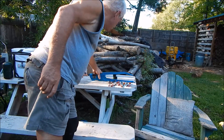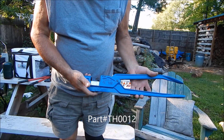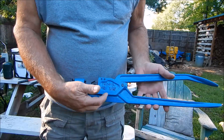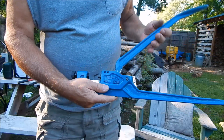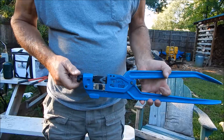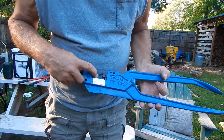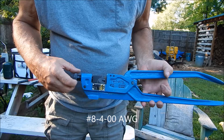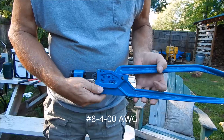The second tool tonight is the Temco TH0012, also available on Amazon or eBay. Both tools have a five-year warranty, and this one is $55 on Amazon. This is the manual crimper — it's a die-less crimper with an adjustable setting in the head. It goes from number eight gauge to 4-0 or anywhere in between just by adjusting the piece in the head, and it works very well.